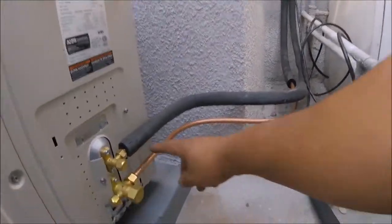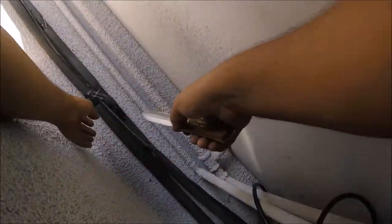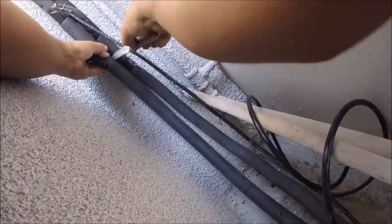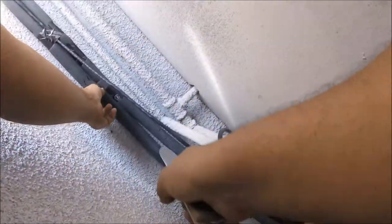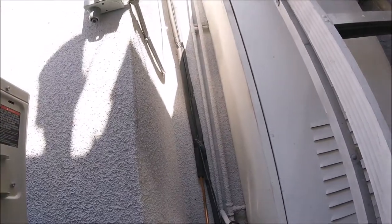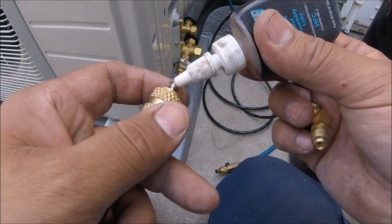This tip is specific for John Israel Jr. Next time they complain about you having to put Rubatex with duct tape really close to the Schrader valves, remember you can always do this — you can cheat. See what I'm doing right there? And then you tape it over in the back where nobody can see.